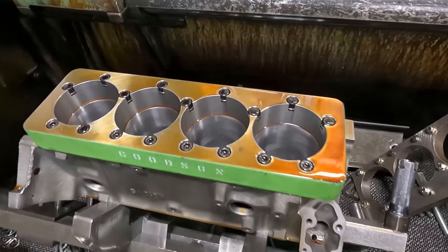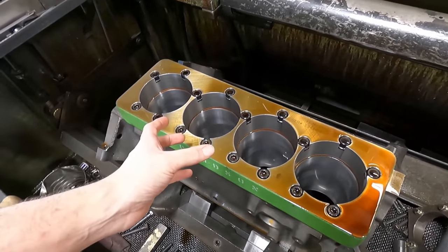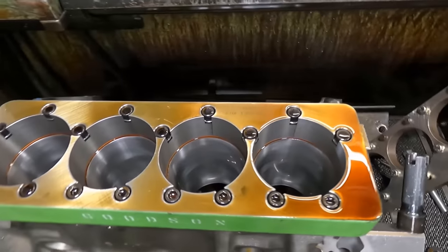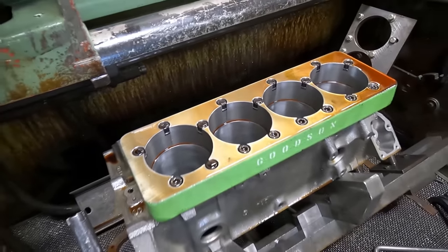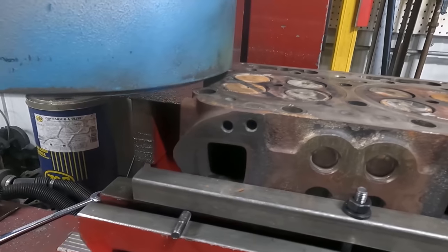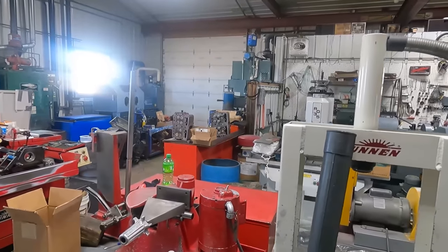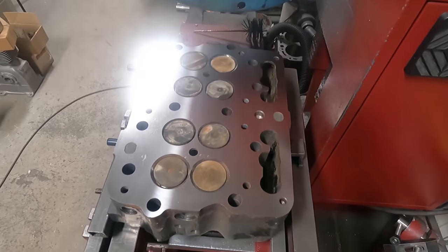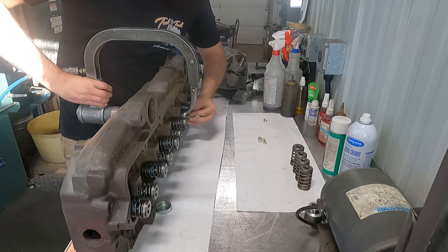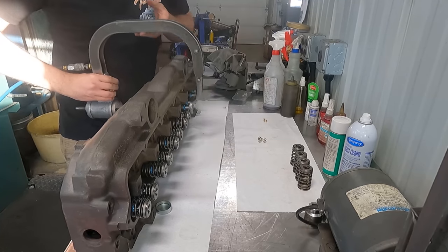I've got the small block here — I've got one bank of cylinders finished. I only have one torque plate, so I'm doing the first half first and then I'll go over and finish the second half, and it's turning out really nice. Also surfacing some N-14 Cummins heads — I've got the first one done, the other two are still over there. We've got so many of those that they've kind of turned into a blur after a while.